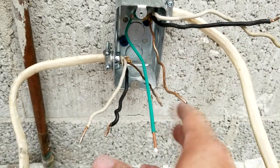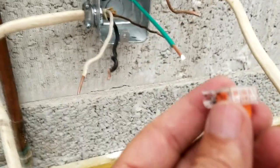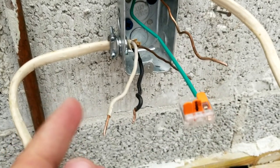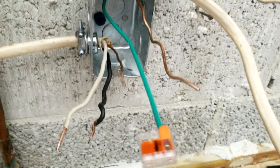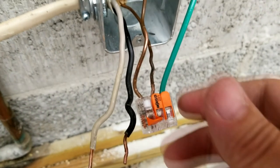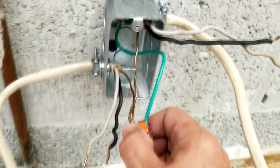I've run my wires all through there and connected the green wire to the back using that green screw. What I like to do then is use these three-way lever nuts — I just insert it right in there like that, close the door down, and then plug the other two ground wires into it. Once I do that, this box will be bonded and we'll have a nice, perfectly connected system ground. Got all three pieces in there now, just going to close down the last lever. All three ground wires are now connected together.